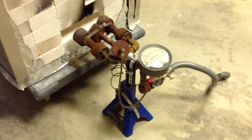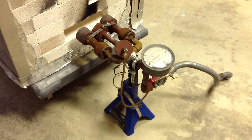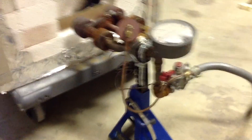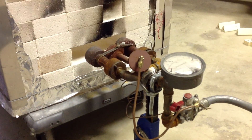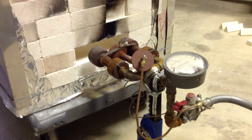Burner system: it's a natural gas burner system, two MR750 Venturi burners mounted on a jack stand with a pilot and a thermocouple — pretty basic setup. One thing I need to change is I need to add a valve to one of these burners so I'd be able to turn it off, because two burners is too much for most of the firing, especially the early stages. I have a hard time slowing it down. But right now it works just fine — it just goes too fast.